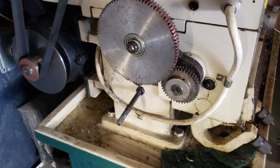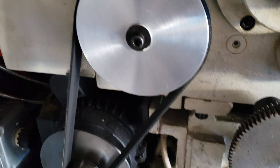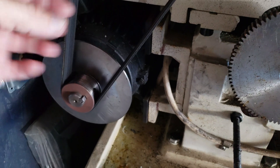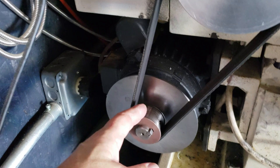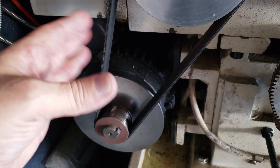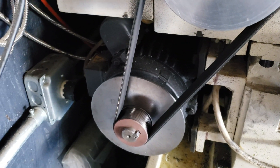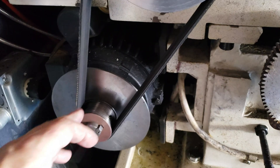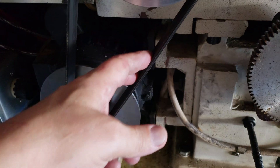The fire department siren test went off. Anyway, this helped lower the vibration tremendously on this lathe. The pulley setup on this lathe was a two V-belt pulley, and the problem was whenever you snugged it up, one belt would be a little tighter than the other. When it was running, you'd see that looser belt just flopping back and forth and you could actually feel it in the lathe. I thought about just running a single belt, which is actually what I did for a while while I was making these pulleys. I'll put the part number of this belt in the description.